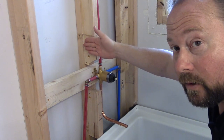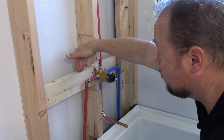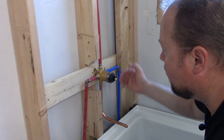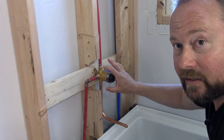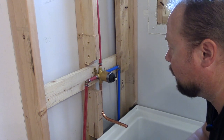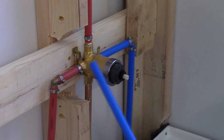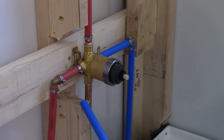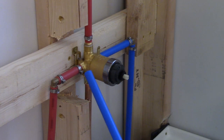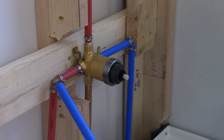What I've got is a 2x4 here, and starting at the back of it — so the backs are flushed — there's a 2x4 sitting here. I just have it cut out where the faucet is and that gives me the correct depth. I've done this by experience and it works out well. I've seen cheap installations that just keep the plastic shroud on and use a fiberglass shell with the trim plate screws holding the faucet in place — that's actually what's holding my faucet in my personal home until I redo my bathroom.